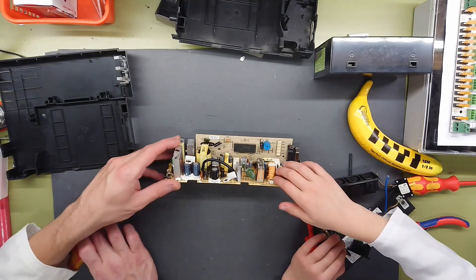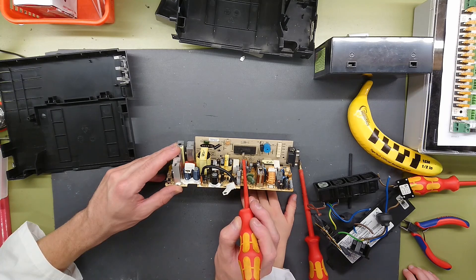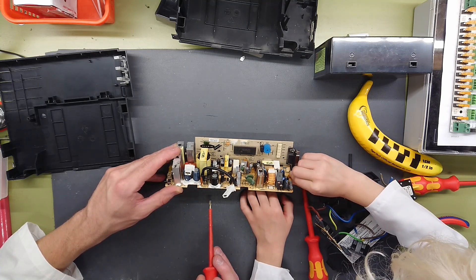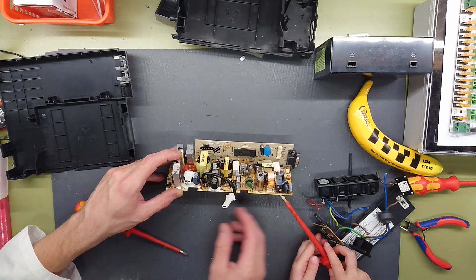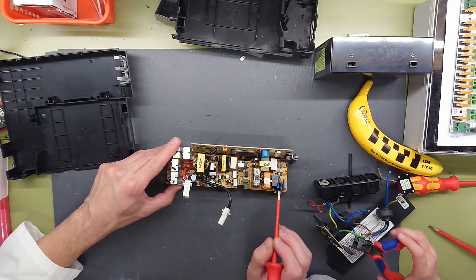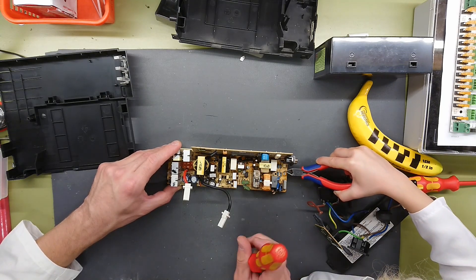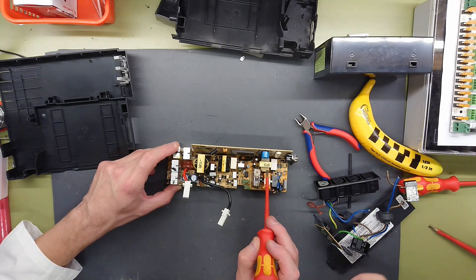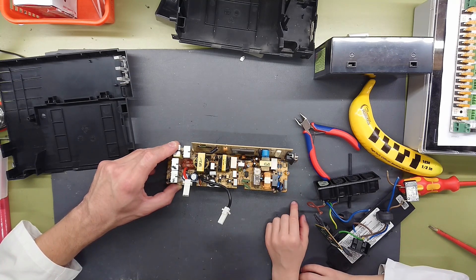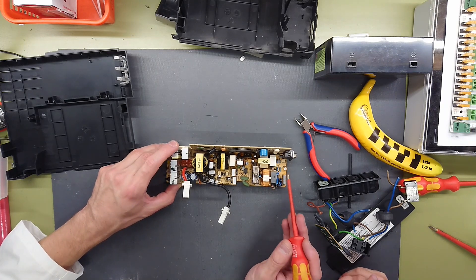It has a large, what appears to be a 40- or 32-pin microcontroller, which is an ST part — the ST-72C340J486. It's a little funny with the 486 designation, as I doubt this is a 486 processor. Going back to the input, we have a regular common mode noise choke, input noise capacitors, and a TVS. We have a relay to turn the output on and off, and over that what is probably a small housekeeping power supply. There's also a tiny capacitor — 470 microfarads at 25 volts — so that has nothing to do with the mains input.